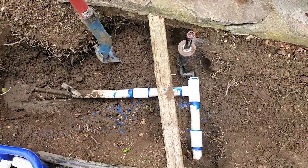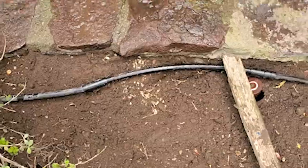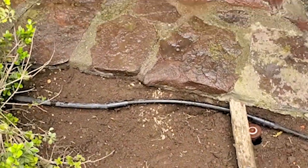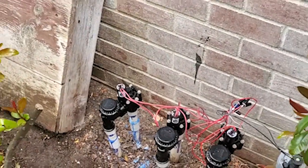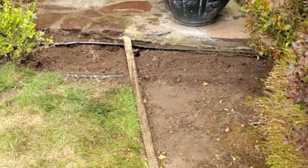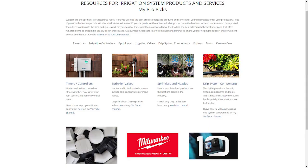I don't hear anything — it's good. I coupled the drip tubing together here and here, ran it under there under the board, and found that it operates off of this three-quarter inch valve here — it's the only three-quarter inch valve on the manifold, so that kind of gives you a clue as to which valve it is. Remember the free downloads that can help you with your irrigation, and also remember the resources site link below that has most of the products for sale that I've discussed in these videos.